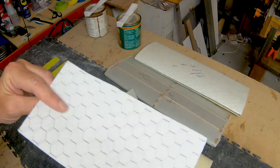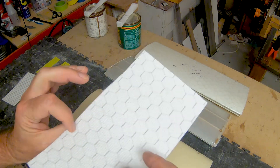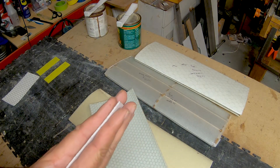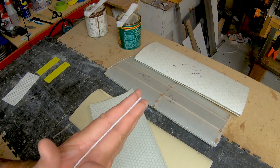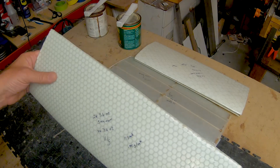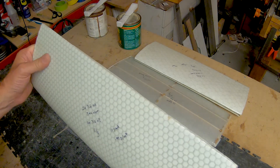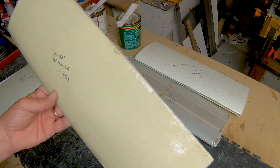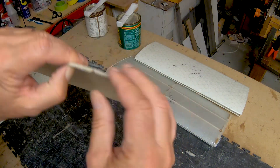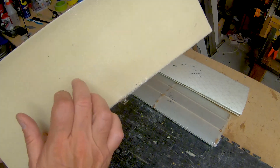This is a different one that I actually like a little bit better — this is two millimeter. It can be used as an infusion medium for resin infusion, but it can also be used as just a core material. As a core material, it allows me to create a layered material with fiberglass on both sides, which gives fiberglass a lot of rigidity. This one has the three millimeter core and is ridiculously strong, but it's just too heavy — there's way too much resin. This one is 56 grams, that one is 111 grams. This is a polyurethane foam — three millimeter — so it's much lighter, using a three ounce glass on the front and three ounce glass on the back.